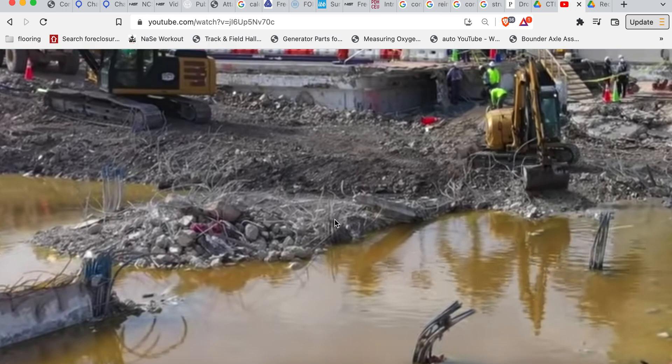KL is also straight. Remember L - we can't see it in the video, but this is the one that the planter box is hanging on, I believe, right here. So there's a BMA going from here to here, connecting here. This is part of its deformation. What's important - look at this rebar coming out of the head here, and its shape in that capacity, straight and over like that, which indicates they also had punching shear, including that this load also punched around it.